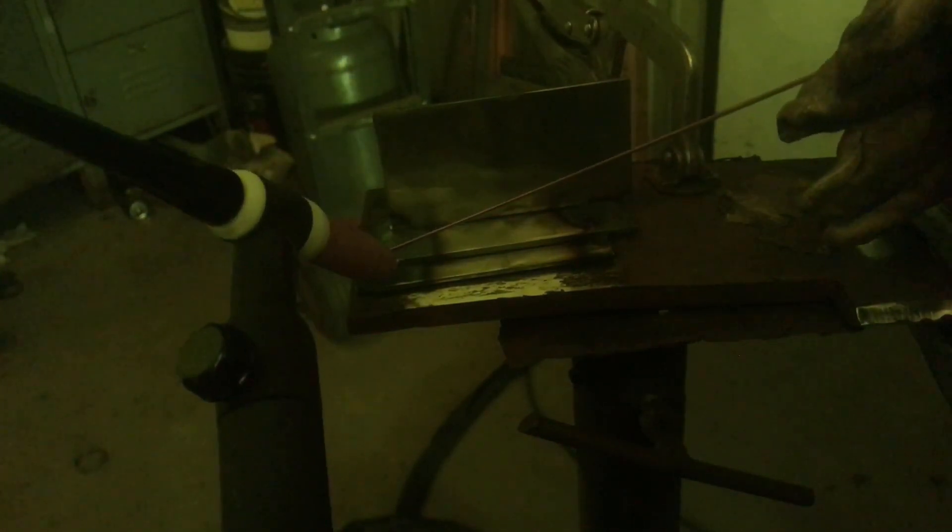From this angle you can see a bit better what's going on. I'm using a 15 degree push angle and I'm striking off the filler rod to do this joint. I'm using kind of a back and forth or a little C motion — sometimes it's referred to as a J-weave — and I'm dabbing as I pull back.